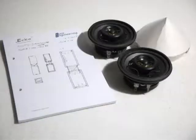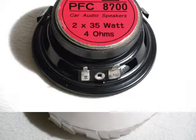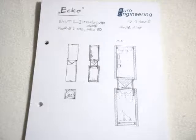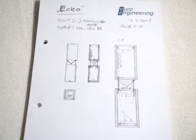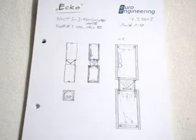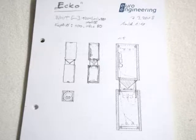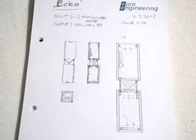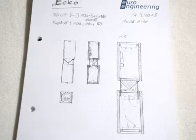This is the material I want to use — these are cheap coaxial car speakers from Conrad Electronic. I quickly assembled this cone reflector and drew the sketch. It will be possible and even necessary to turn the speaker upside down so that dislocation of the membrane is prevented. That's a known problem downfire or upfire systems have. It will have two chambers: one for the driver, probably a leaky closed box because car audio drivers usually have a high QTS, and one for the crossover network.